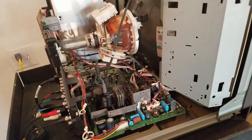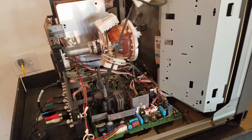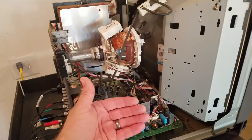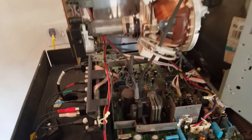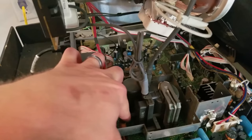Back behind the PVM now with the cover removed. Once you have your screws out, you just want to slip that — pull the shell — stand behind the monitor and pull the shell backwards, and it just slides back and comes right off. Now the part we're looking for to adjust our focus is back here. It's on this flyback 90% of the time, and it's on here on this one. There's a little black potentiometer knob down there if you can see it.